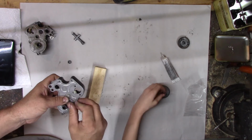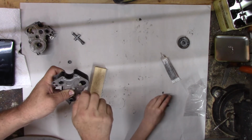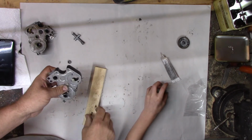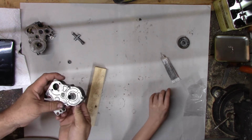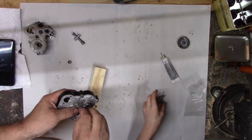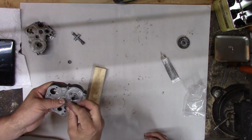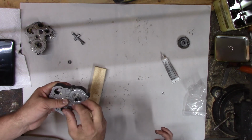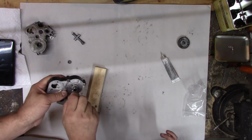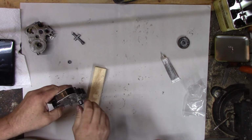So this pin would go inside these. Yep, it goes in that bushing. And what does it do? Same thing the bearing does. It keeps it from rubbing metal to metal, or at least it keeps a bronze bushing, because the bronze won't gall together with the steel, so it acts like a bearing. Kind of like that Babbitt bearing you were talking about. It's just a different kind of metal. It spins pretty good too. It does. It runs on oil, a little oil film. Oh my goodness.